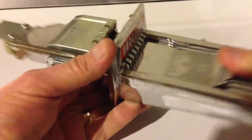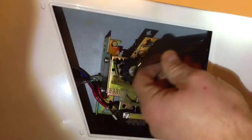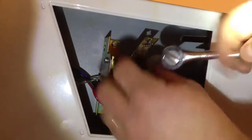I'm going to check my operation again, and the spring seems to be working well. So I can go ahead and put my coin mechanism back in. You'll see three holes at the top — the center one is where the screw goes, and the outer two are just for alignment. So now I'm going to go around to the access panel, take my long screw, and it's kind of hard to reach.